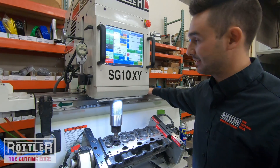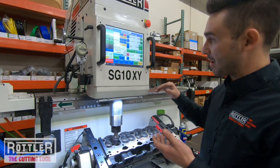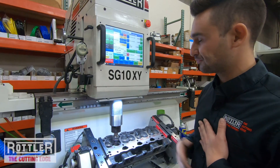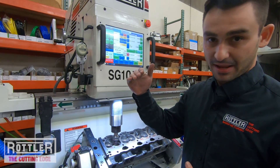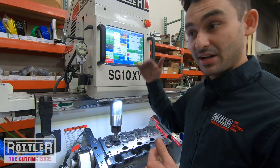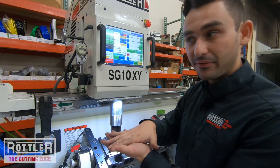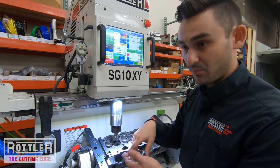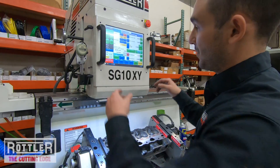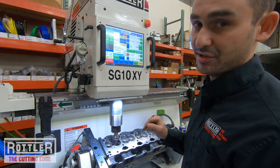We kind of just guess and check using the Auto Cycle Additional Depth button. This lets me change my finished cutting depth — I can go to 10-thousandths, 50-thousandths. When I rerun, it always starts at that 50-thousandth start cutting height and feeds down. If I want to keep going a little deeper I use Additional Depth — it skips to about 5-thousandths above the last depth and cuts a little more. So up here I have 2, 5, 8, and 10-thousandth additional depth options.